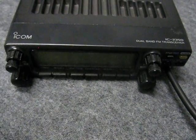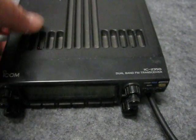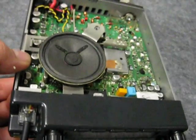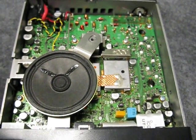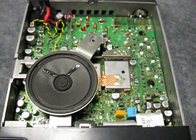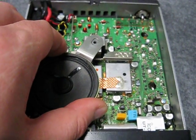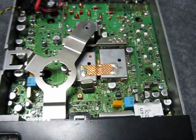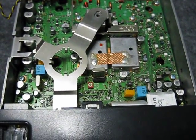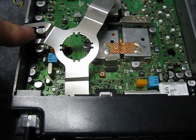But it wasn't quite as easy as that. I'll just show you what I had to do to fix it. And we'll flip it over. And here you see the inside of the radio. And it's not quite as simple as I thought — all the electrolytic capacitors are all surface mount, so it was a little bit more fiddly than I thought. And to disassemble this radio, what was needed was to pull the whole thing apart, basically. The speaker comes off.